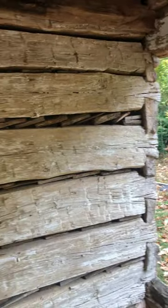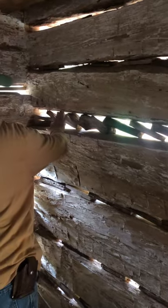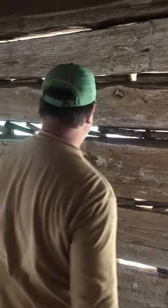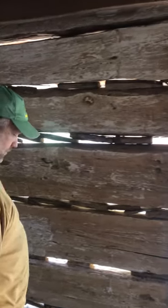And then if you walk here on the inside, I don't know if the light's good enough in here. So this is the inside of the joint we just did, and you can see we check and make sure our daubing will lay back, which it will. We'll fill all this in with daubing, which is a mixture of lime and sand and white Portland cement on this project.